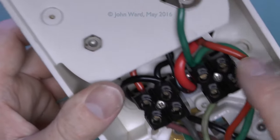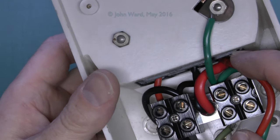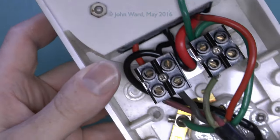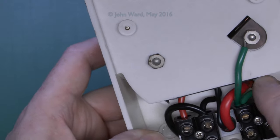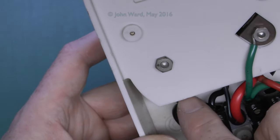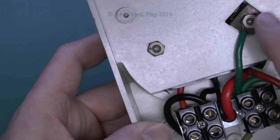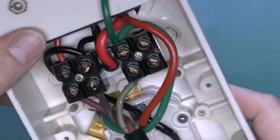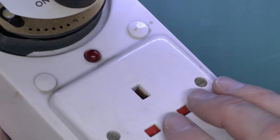You can see that the black and red there actually just go up into the block here for the neutral. Then the red, which is obviously the one that's switched, goes up into the timer itself. Then your incoming line here - again the neutral is just permanently connected through, and then the incoming red of the line goes up into the timer. So it's just in at one side and out at the other, and then additionally you've got power to the timer which is connected inside. The earth ones just go down to the metal of the casing here and the timer at the top. I'm not sure of the particular age of this but it's going to be fairly old - probably sort of 1960s or something. It's just basically a normal 13-amp socket that's been screwed on the bottom of this plastic moulding.